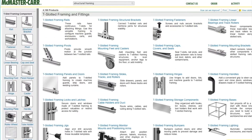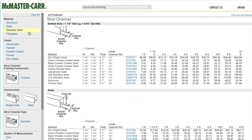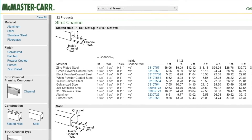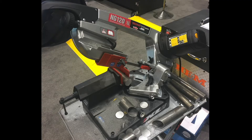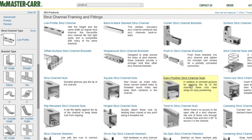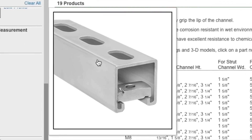So let's start with Unistrut, otherwise known as strut channel. It comes in several different metals and a few different colors, and has a single attachment face — that is the side with the channel, in which you drop in the nut that rotates 90 degrees as you're tightening the hardware. Strut channel is normally cut on a bandsaw. There are many brackets and gussets used for building floor-standing or wall-mounted structures, but the fundamental accessory of a strut channel is the nut. It's what makes Unistrut so flexible.